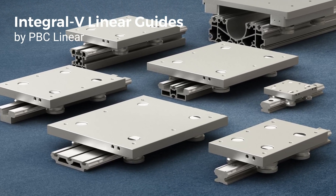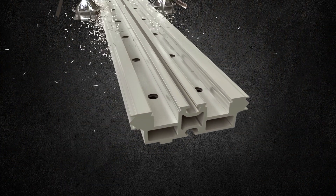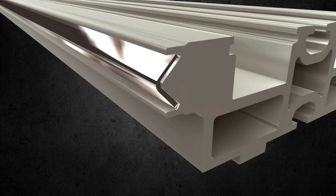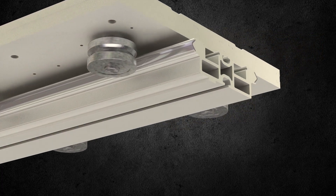IVT is a product solution that allows us to take aluminum extrusions and machine them very flat and very straight through our patented process called SIMO. The end result is a single one-piece rail design that's flattened and straight with accuracies comparable to H-accuracy linear guides.